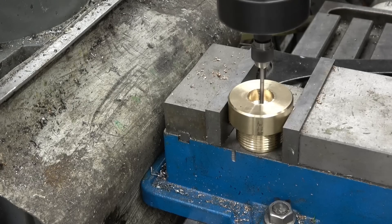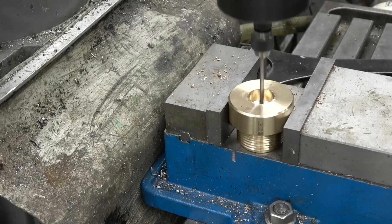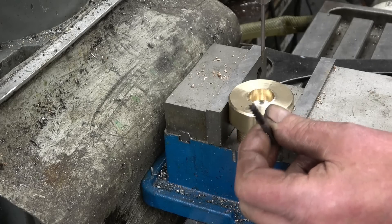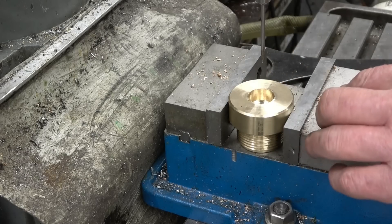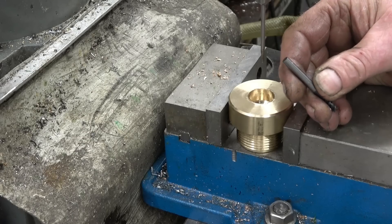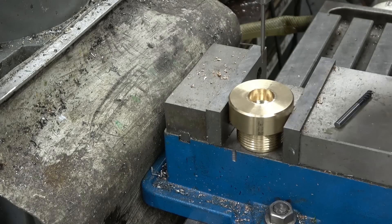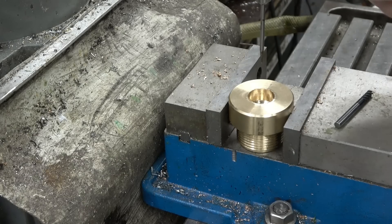Right, it's just about dead on there. So at zero, the DRO will know that's the centre. I've got a small milling cutter here. I've got a few the same size so we're in with a fighting chance of getting this done without breaking too many. So we need to measure and see what size that hole's got to be — obviously minus half the thickness of the milling cutter. A little bit of maths and then we'll set some stops up and go about getting this thing machined.